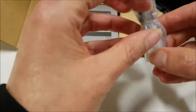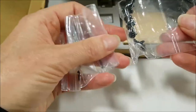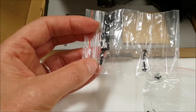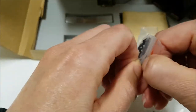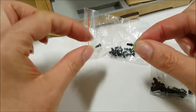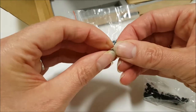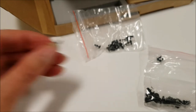Let's go over the rivets first. There are three different sets — I call them small, medium, and large. The medium rivets are in a package all by themselves. These are two-piece click-lock plastic rivets, so don't try tearing them apart. You simply need to push them through the material and they will open by themselves to lock in place. See, they have a bottom and a top, and if you push it together it flares out.